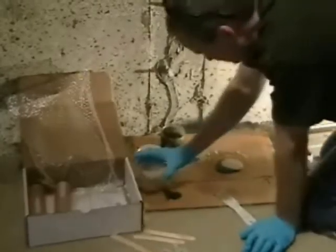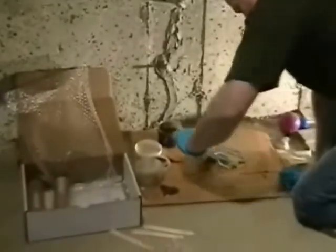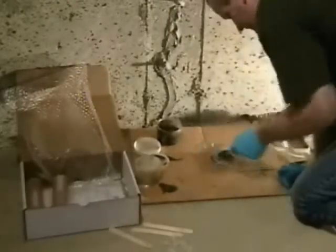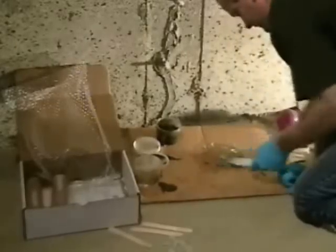Now we should note, you're going to know the surface seal is ready for injection, and it might be 3 or 4 hours, but it'll be fingernail hard. You try to dent it with a fingernail and you won't be able to, you'll know you're ready for repair. You'll know you're ready for the injection part of the repair.